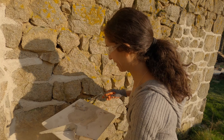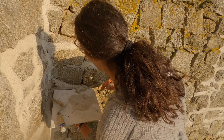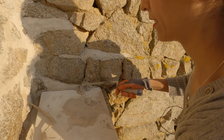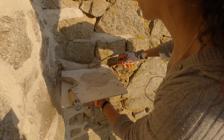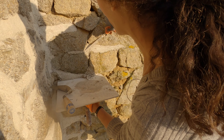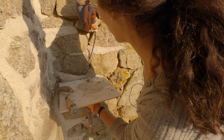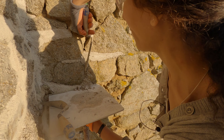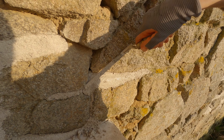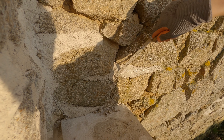You can do pointing in different ways. I like doing it like this because I like the curve of the pointing and it just flows with the building. The other way is you can flatten it in between the stones, but you need an even wall. What you have to make sure is that your lime mortar is protecting your building and that you don't end up with water flowing into your wall — because the last thing you want is to make a ramp for water to flow down your wall and into your wall. So if you have really uneven walls, you have to do it in a manner where you're not going to get damp.